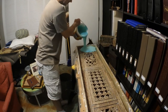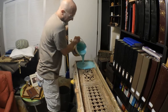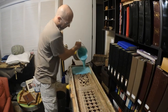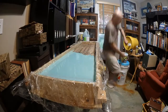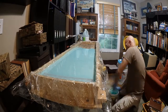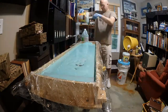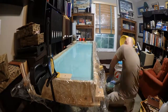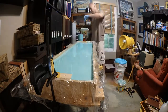By pouring it slowly, you can pop more of the air bubbles as it comes out, which is nice. But you also have to keep in mind you can't do this for too long because you've already started the catalyzation and the polymerization process. So you're trying to pour it smoothly and evenly so it flows well into the cracks, but doesn't trap additional air bubbles.